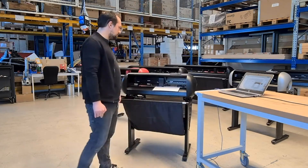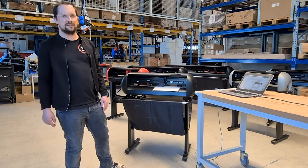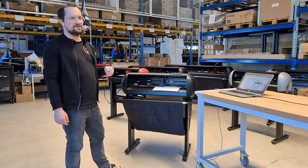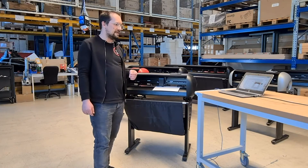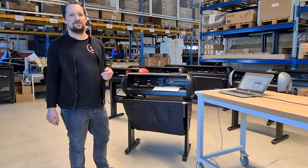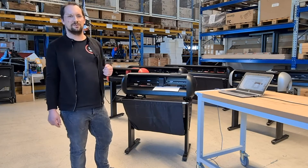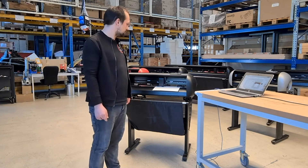For example, if you have a T60 vinyl cutter plus a flatbed cutter, every machine has a slightly different offset. As you don't always want to recalibrate, you can simply read the right offset from the machine. It helps whether you switch machines from time to time or use multiple computers to control the cutter — you always get the right value from the machine. You only have to do it once for each machine and then store the value in the machine memory. Note that writing the offset into the cutter memory is only available on the Lapos Q controller and only works with the T2 series, the flatbed cutters, the roll-to-roll label cutter, and the sheet label cutter.